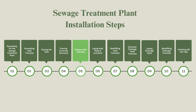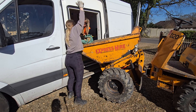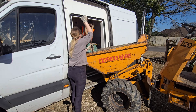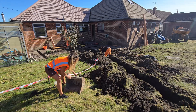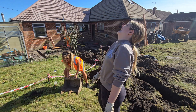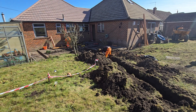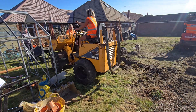To prepare the trenches for the inlet pipes, we laid a bed of pea gravel. This provides a stable but flexible base, helping to drain water, support the pipe's weight and prevent damage. Pea gravel is also great for protecting against ground movement and soil settlement, as its smooth round texture ensures pipes aren't punctured or damaged. Ideally you want to lay at least 100mm of pea gravel on the base, and then the same amount on top of the pipe.